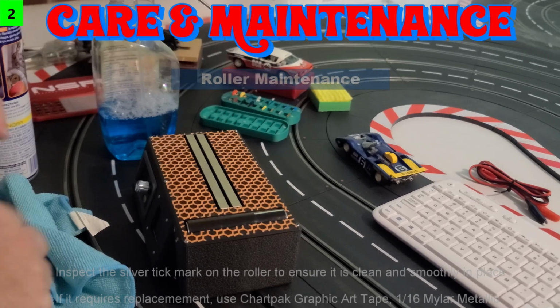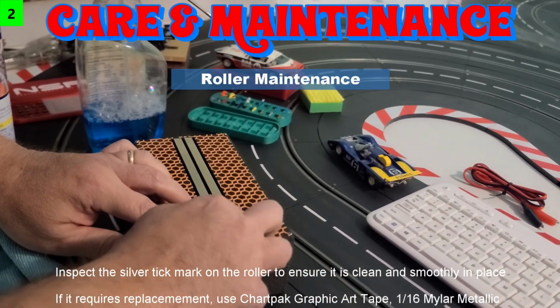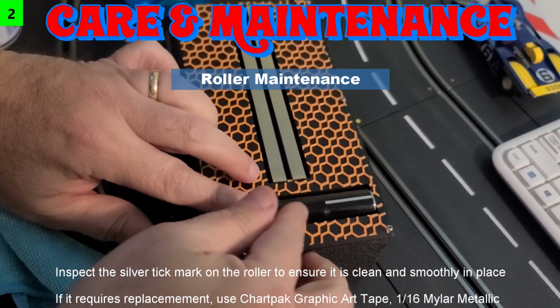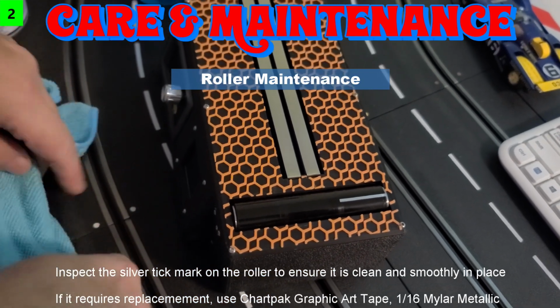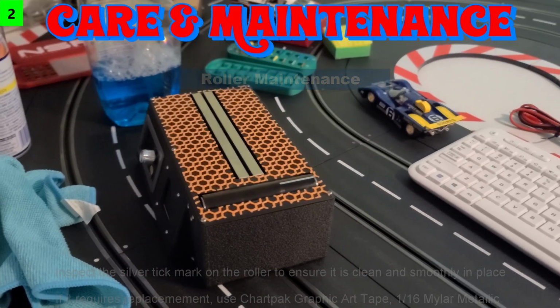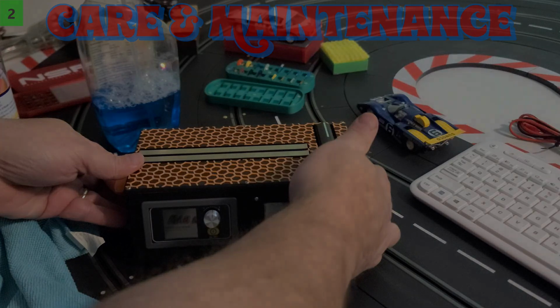Inspect the reflective marker on the roller and ensure it is clean and undamaged. Should you need to replace it, any 1/16" reflective pinstripe tape will suffice. For a direct OEM replacement, use ChartPack Graphic Arts tape in Mylar. Lastly, remember to always handle the Tech Bench with care. Don't drop it or handle it roughly.